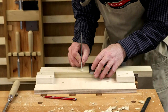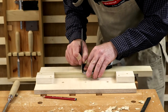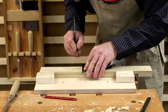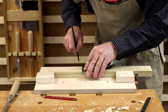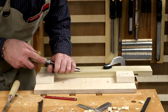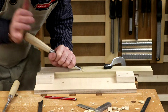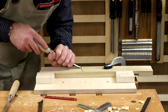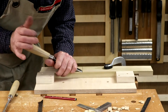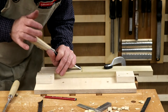Slide the knife, drop it in that groove. A little bit of pressure, pulling through each cut, extending that down a little bit. Going to create our knife wall. I've still got to do the cutting gauge marker, but I just thought while we're here, it's positioned. I can still do this now.